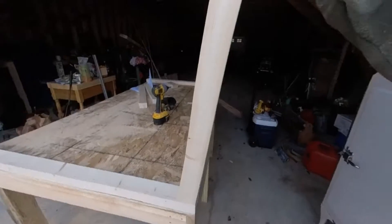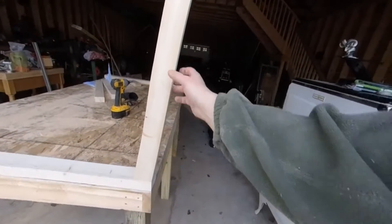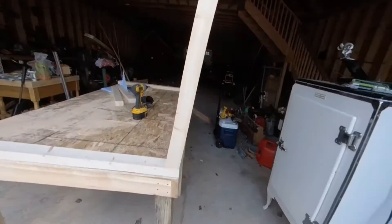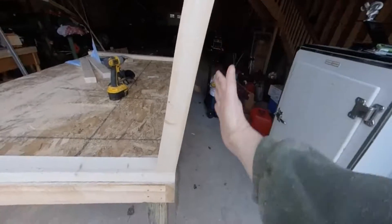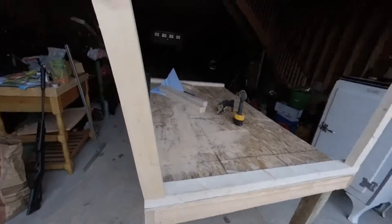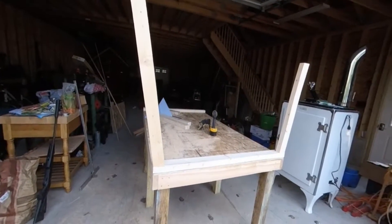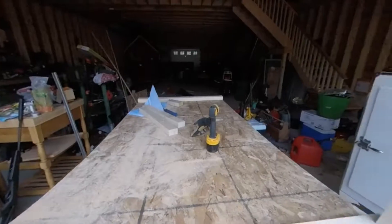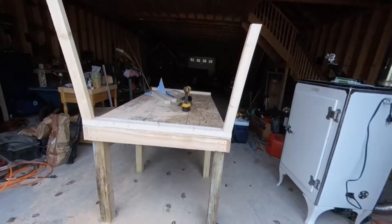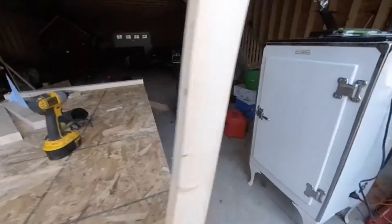The short side here I measured 27 inches — should have been 30, knocking off for the bottom plate and the top plate. An 11-degree angle seems to give me what I wanted; I wanted it sticking out about six or seven inches on the side. I did the same on this one — 11 degrees. I think the total height was 33, should have been 36 with my bottom plate and top plate, and I think it looks proportionate.